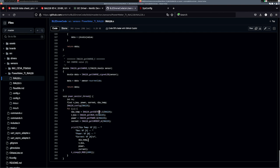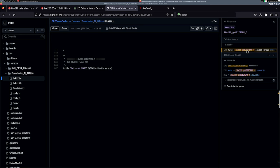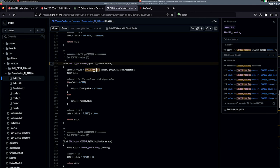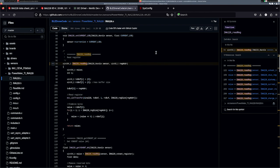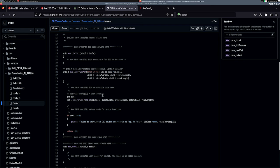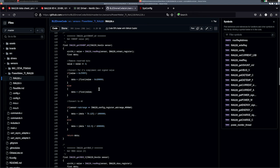If you want to know what it's doing, it's reading information from the I2C data and converting it into a readable format. If you click on the INA228 read register, you can see it's initializing the buffer, sending it to the MCU I2C transfer — which is the code we saw earlier that does the actual writing and generates the I2C — and then performing simple mathematical calculations to convert it into a much more readable format. This is all given to you, so it all makes sense.